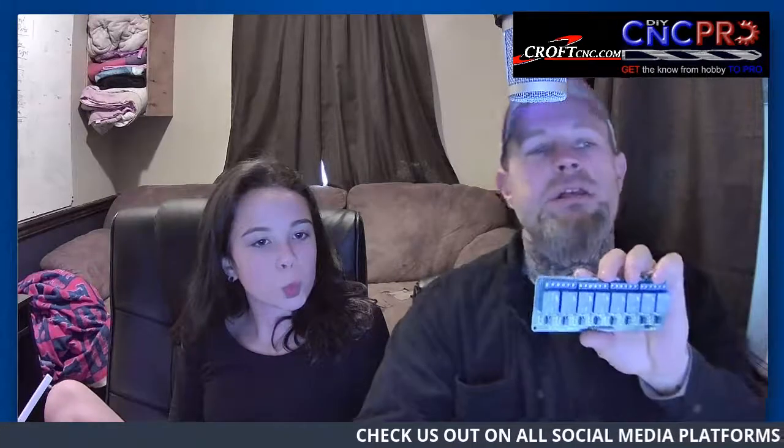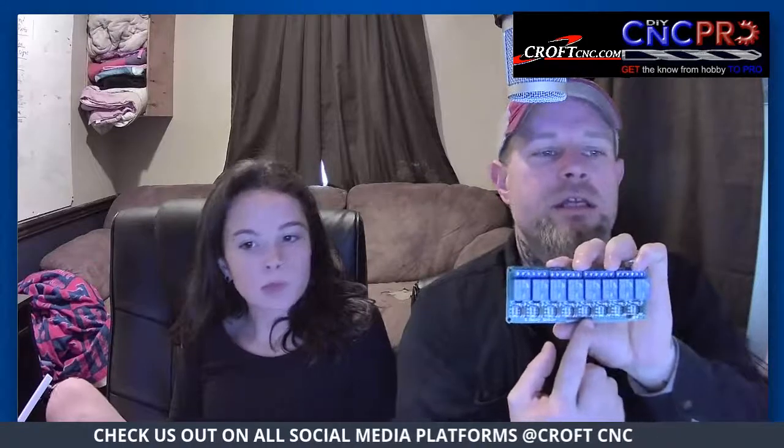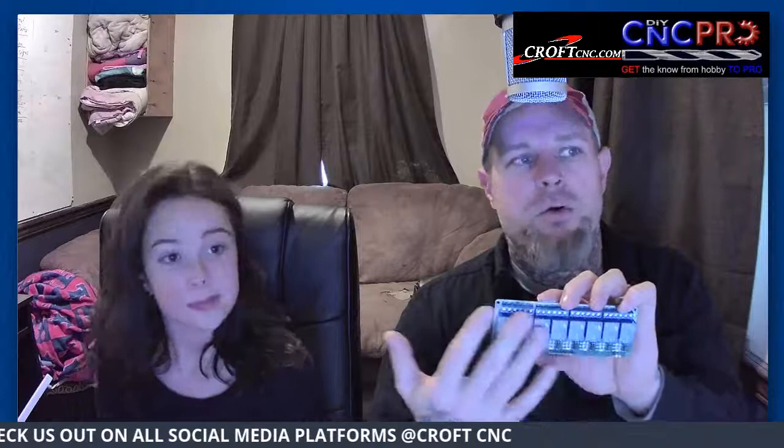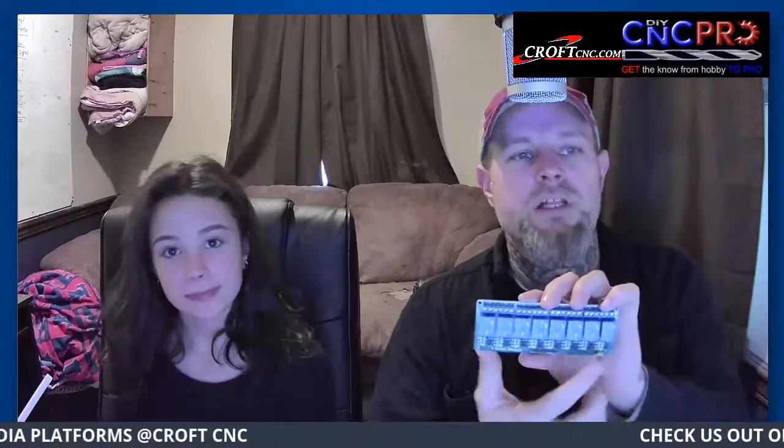But basically, I can run these into a switch and run the ground into the switch and then run the other side of the switch into the input pin. And whenever that switch is hit, like I can hook it up like a limit switch on a router, it will trigger these relays. So I can basically just take a bunch of relay switches, put them on different parts of fixtures and machines and travel points, and these will all be triggered. So I may have a stack of these labeled input 1, input 2, all the way into input 256. And all of them have switches that do different things.